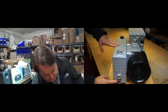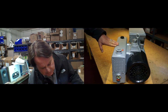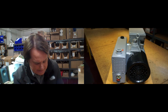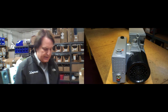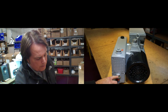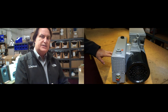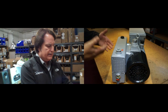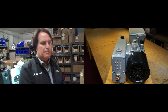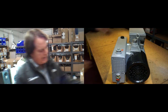Another nice feature is a built-in drain valve. When it's time to change the oil, you can get a fitting that hooks right up to that into a bottle or whatever containment you choose. You can see the sight glass right there — we like to see the oil about three-quarters up. There is a float in here. As the demister traps the oil, it lands into the exhaust box. Once the float rises, it allows that oil back into the sump of the pump.